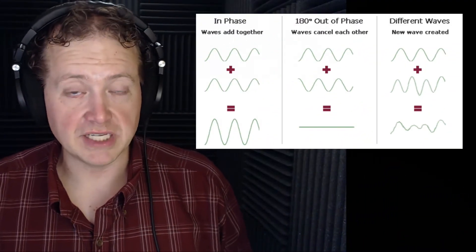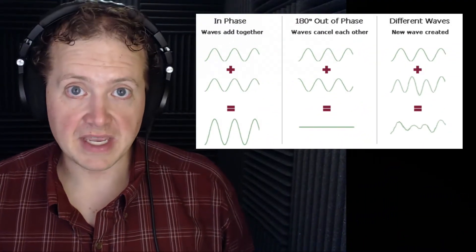If you're recording sound with one microphone, no problem. But if you're recording with two or more, you want to pay close attention to where those microphones are pointed. If they're both on the same source, those microphone crests and troughs may not be perfectly aligned with each other. If they are slightly out of alignment, that crest and that trough may be canceling out some of the voltage — therefore they are out of phase.